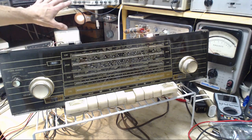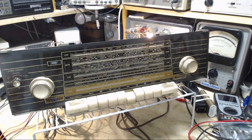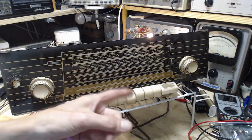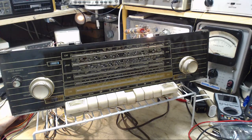So this came on fairly bright because the radio hasn't been on for a while and it's got no charge in the power supply. That's my guess. So it takes a pretty good whack at first. That's a stupid statement because you can't charge the high voltage power supply till the rectifier tube. Oh, there is no rectifier tube. That's right. This has still got a solid-state rectifier in it that I've got to deal with, too.